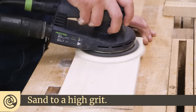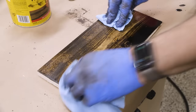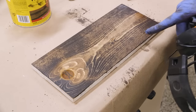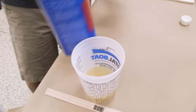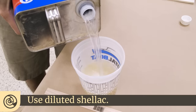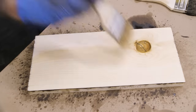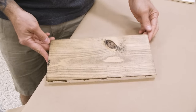Here are a few traditional ways that woodworkers keep blotch at bay. Sand to a high grit — this tends to crush the wood fibers and block them off to some degree. We use this trick all the time to help end grain not be so thirsty, but the results are not exactly predictable. You can use high grit sanding in conjunction with any of the other treatments for even better results. A classic method I've used many times is diluted shellac. The shellac partially seals the surface and definitely helps prevent blotching, but in doing so it also prevents the finish from absorbing in general, and you can easily end up with a color that isn't quite what you expected.